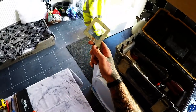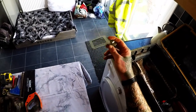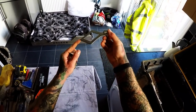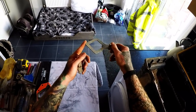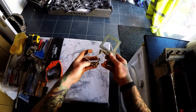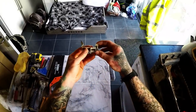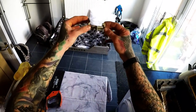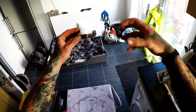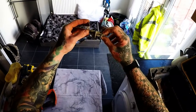These should be in my profile bucket as well. This is a Blake setting-out profile — you just hook it over the top, it sits on your brickwork and locks into your profile. I'm going to make a video on how to set up a Blake profile in depth. And these are just stabilizers — once you get to about six courses up, you put this on your profile and adjust these to bring it out where the line's tight, to stop it pulling the profile over.